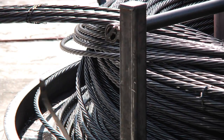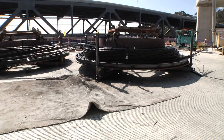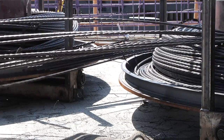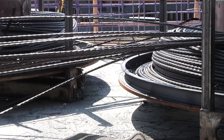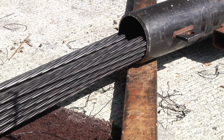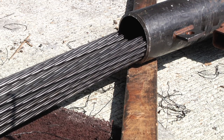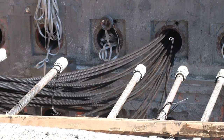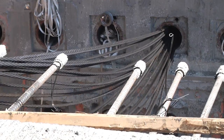The amount of steel on the inside of this concrete structure is tremendous. There's over 17 million pounds of steel inside this bridge, and over 21,000 pounds of it is these post-tensioning strands. It takes about ten days to snake those tendons through the bridge, but adding all the steel is just part of the process.